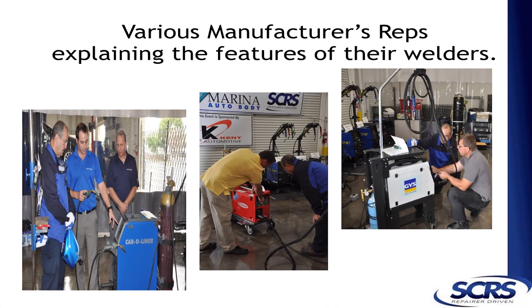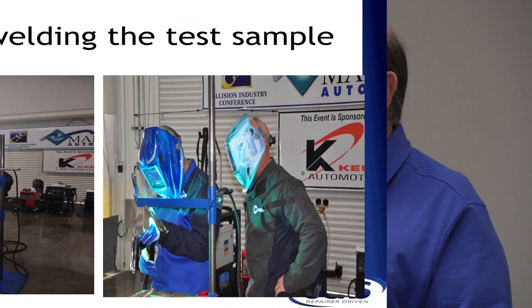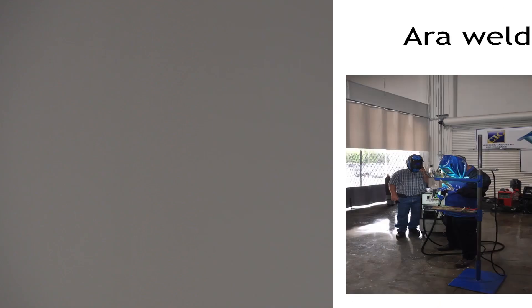I brought in a gentleman who is a certified Mercedes welder. Each of the manufacturers went over their setup and showed us how to load the wire. We gave all the manufacturers two parameters: bring in 5554 wire, 1.2 millimeter diameter. When they got there I said, okay, you've got to be welding down this thin material — we'll see if you can perform. All seven manufacturers were able to perform. They all succeeded in performing the weld, and we tested them per ICAR standards, looking for penetration on the backside and then doing a destructive test.